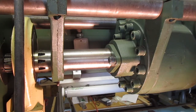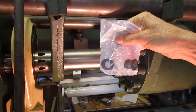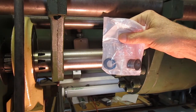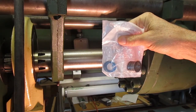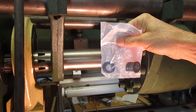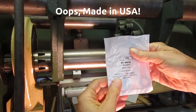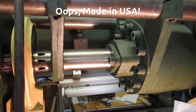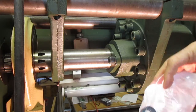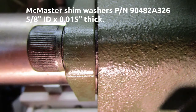It's a pretty simple process. I got these shimming washers — you can probably see these here. They're 15 thousandths each. I'll get a graphic up that gives you a link to our part number for these. Get them from McMaster-Carr. These are 15 thousandths each.